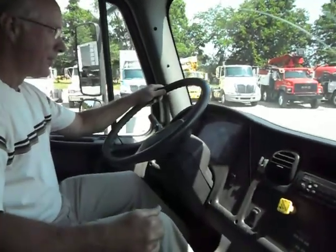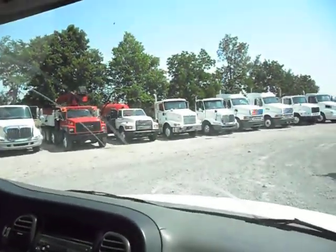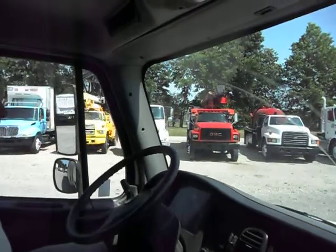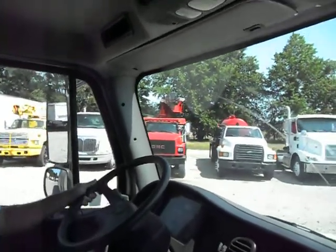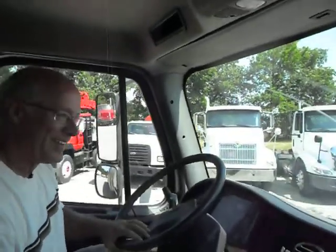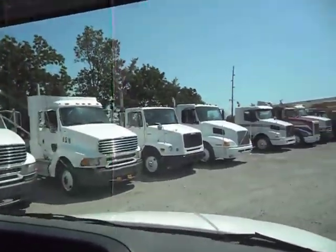Okay, parking brakes released. John, put her in low first. Now, folks, in all seriousness, I'm going to hold the camera real still out the window. We are at absolute first gear at an idle. Now, look how slow this sucker goes. I'm telling you, the low hole granny gears is at a snail's pace. The snail may even outperform it, I'm not sure. But I'm telling you, folks, if you don't have that low gear, you're not going to bring 700-800 bushels out of the field without smoking a clutch.